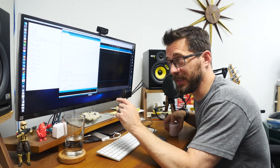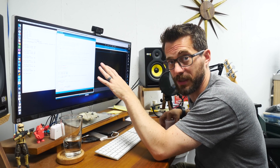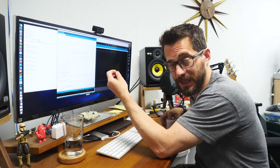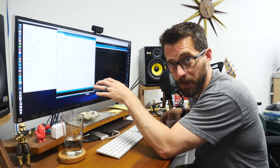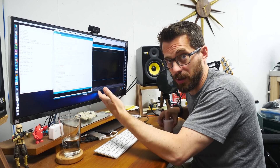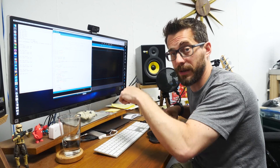This thing is still setting up, so let's talk about the code a little bit. Basically, all of this code I found on a really great website that had an article explaining this entire process. I'm going to link it down below because it will have all of the specific information that you need. Essentially, in the code, the only things that you have to customize are your Wi-Fi credentials so that your module can get on the network, and then you give each one of the objects a name. So if I want this finger to be called finger, I just put it in the code. There's also a function called a callback, which is the thing that happens after it hears back from Alexa. So when you call out to Alexa to do a thing, the module hears back from her and then executes some action in the callback. The code is not very complicated if you have any programming experience at all, so be sure to check it out. It'll be on my GitHub, and I'll link to the original article that I got this code from down in the description.